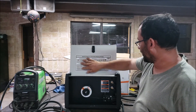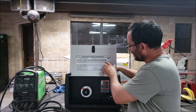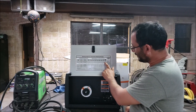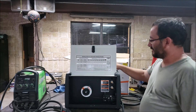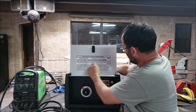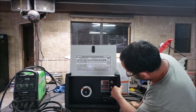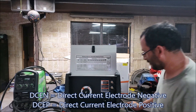It is a heavy machine. I've got a good chart here — we're going to be using quarter-inch steel for testing. It's rated for 3/16 inch at voltage number four, so we're going to set the bottom dial on four. The chart indicates the wire speed should be around 35, so we'll set it at 35. This is using flux core wire.